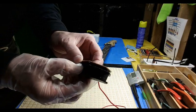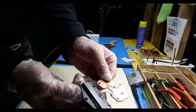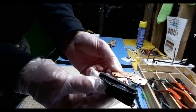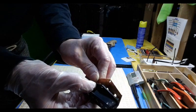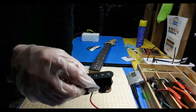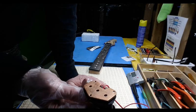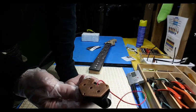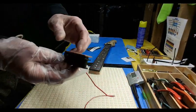Look what I found when I took the Donner bridge off - the plate is copper-looking, so it's plated, and it just sticks to this bar magnet on the bottom with a little ground wire. Cost cutting measures. I haven't had much experience with cheaper bridge pickups for teles. Oh yeah, by the way, there was no bridge grounding wire underneath there for this either. I'll have to add one.